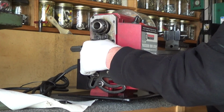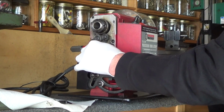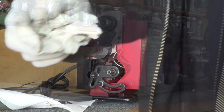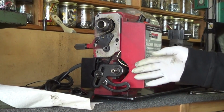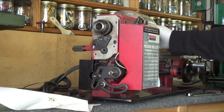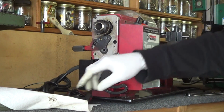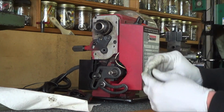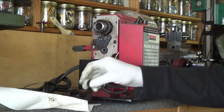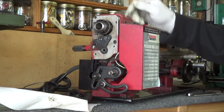Well, I guess I get the magnifying glass out. Oh, there it is. No, it was just grease. Or is it? Well, magnifying glass time, and clean them up. Alright, I might be pretty lucky here, because taking it all apart, I don't see why engaging this would make a noise happen inside. But what I did, all the gears are fine except for the gear that was here, which was the first one. It's got one tooth that's kind of bent over. So I used a little jeweler's file on it and tried to just kind of fix it up. Next time I order something from the little machine shop, I'll order another one of those gears and replace it.